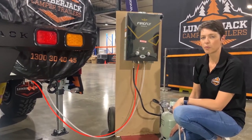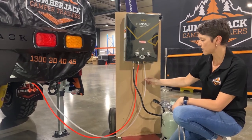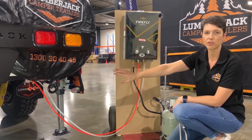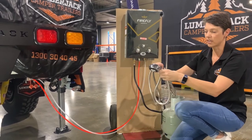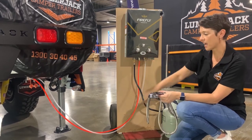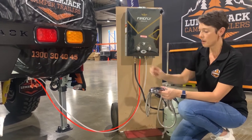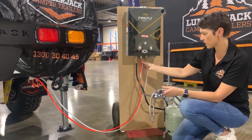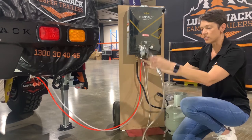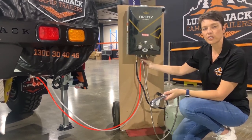The other way you can have a shower with hot water is to take the hot water system and reconnect the shower hose that we provide. Normally the water comes out of the trailer, goes through the unit, and back through the trailer. But if you reconnect the shower hose we give you — instead of it going down the red line back into the trailer — it becomes a standard shower. That's another way you could have a shower using the hot water system and the trailer.